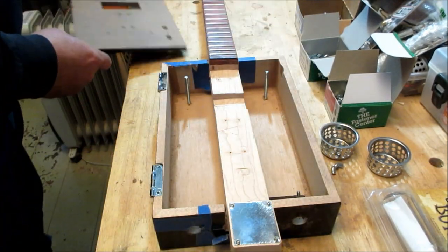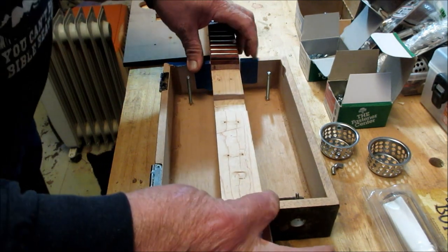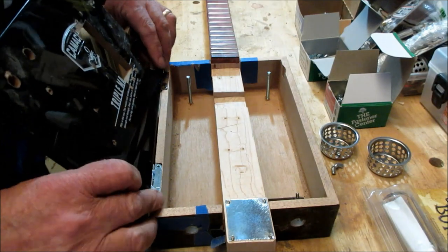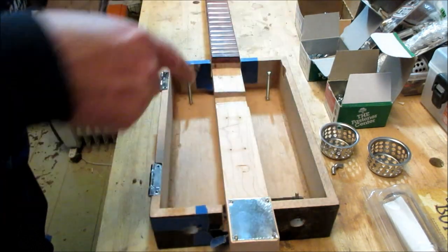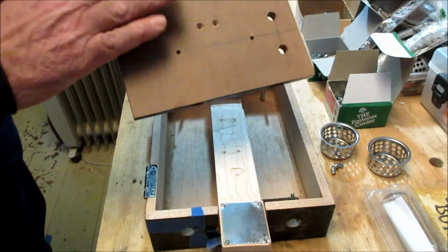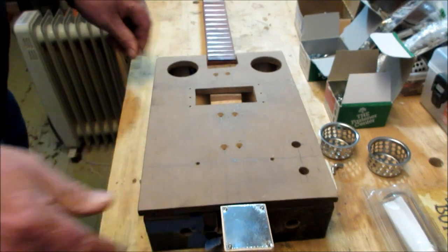When you're cutting the cutout for your box where the neck goes in, make sure there's enough room on this side. When attaching the neck, make sure this is not attached yet — because if it is and we find that these cuts aren't enough, we're trapped. So we're going to unscrew the box top from its hinges, get everything set up where it needs to be, and then bolt it up.